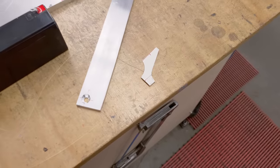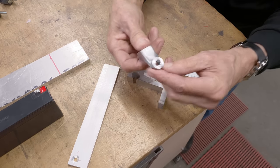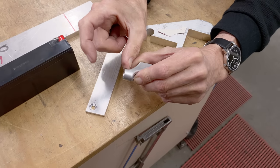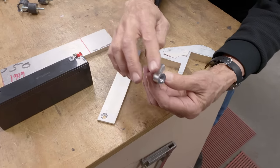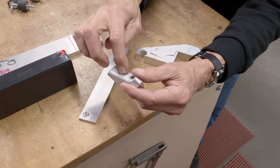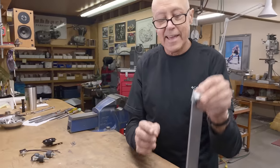This is the piece that I cut out of a piece of metal. I put the cardboard on there, went to the bandsaw and did some shaping. Then over on the lathe, Mitch is going to show you an image of how I had this mounted on a shaft. I put a bolt through and I could spin that — that's how it got to be round. Part of this was done on the lathe, then I did some hand filing. I drilled the hole here — I didn't go through, I was very careful. This goes on the bike with one six millimeter Allen screw and hangs down.